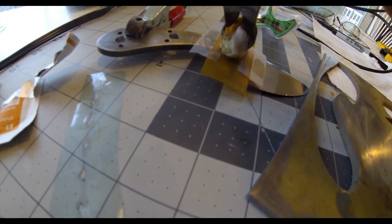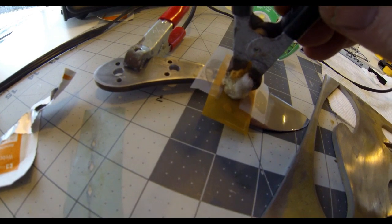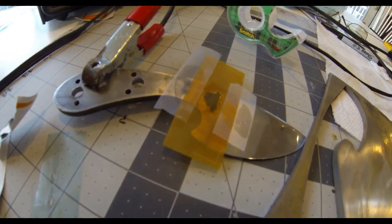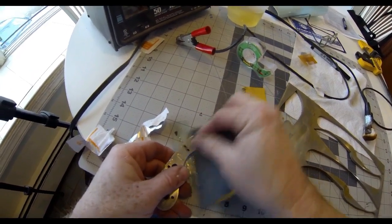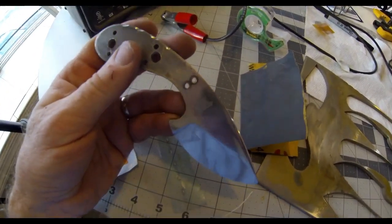So let's get back to the current project. I wanted to have the maker's mark, so what I did was I polished the portion of the blade that the maker's mark is going to go on, and then I etched that in place. I have a separate video on etching maker's marks — it's a pretty simple process. Once it was etched, I polished it as I normally do with 1500 grit paper. That gives me a nice little maker's mark logo that's very legible.